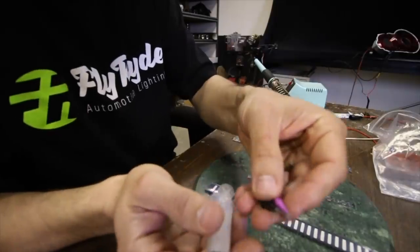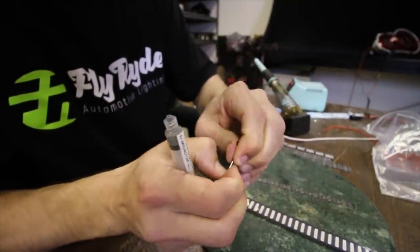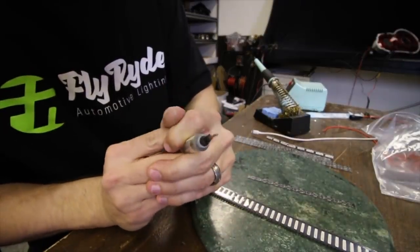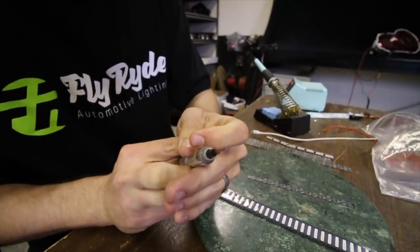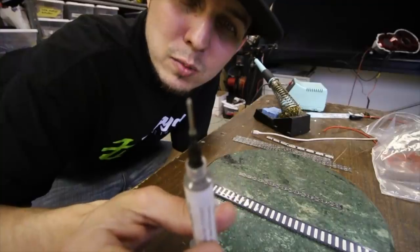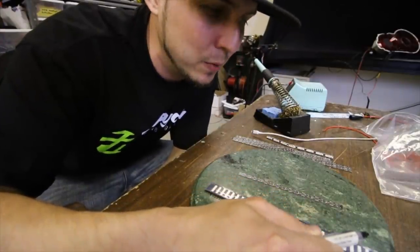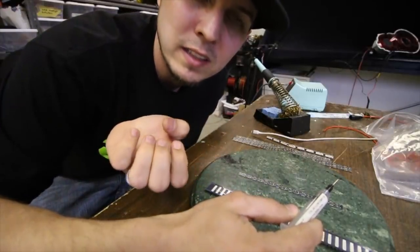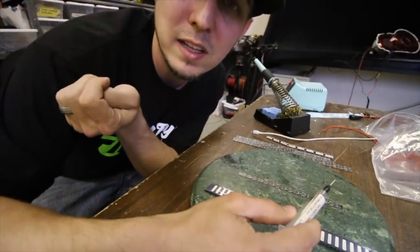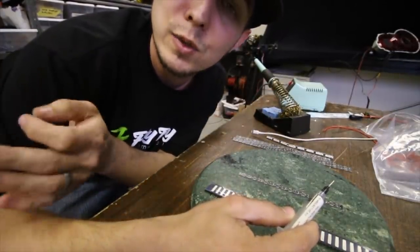I don't have that much solder left in here and I hope that because it's past the expiration date it's still good — I'm willing it to happen. I've got a couple different little application needles that came with this. So I'm going to hook one up right now and give it a little push to see if I can get it to come out the top. Solder paste is going to be put very sparingly on the little connection pads. When we put the LED on top and hit it with heat, it's going to liquify, bond to the circuit board and to the LED at a lower temperature than the soldering iron — that thing's probably like 700 degrees plus. The heat gun will not be nearly as hot and we can adjust it so it's not too intense.